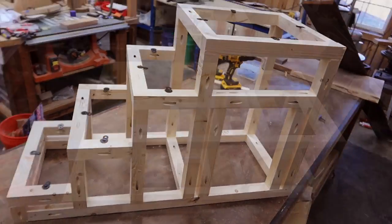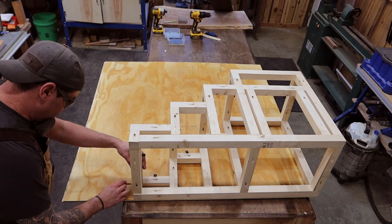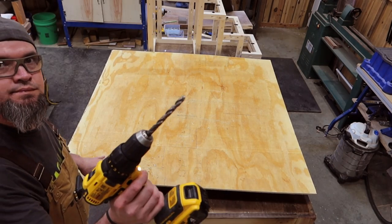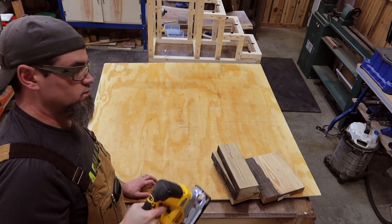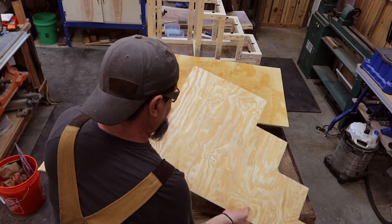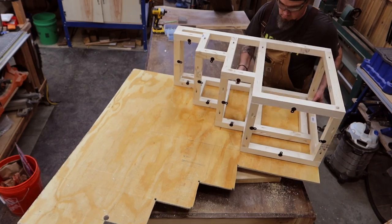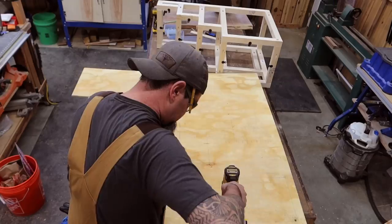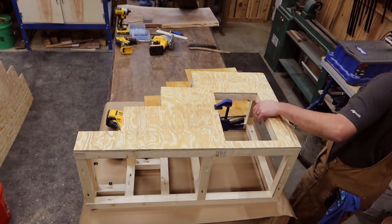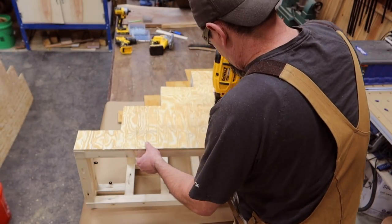With our fasteners in place, let's go ahead and install our sides. I decided to use a sheet of beadboard — this is only a 4x4 sheet, so from a full size sheet you can actually get two of these out of it. Turn the beadboard upside down and trace out one of your frame sides. Then I pre-drill some holes so my jigsaw blade can fit in at all corners, and then cut it out. Remember, the beadboard runs in a specific direction, so keep that in mind when setting up for your second cut — and trace out the pet door opening on that side. I'm adding wood glue to any parts that will touch the outer wall, then tacking it down with inch and a quarter brad nails, putting brad nails around the edges where the trim will cover them for a much cleaner looking product.